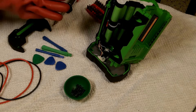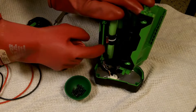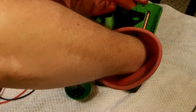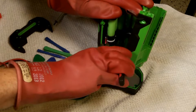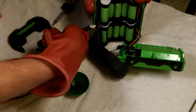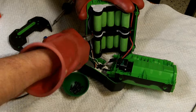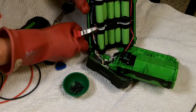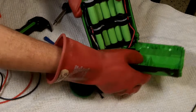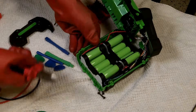Because I am disassembling this, I'm going to cut this mid-pack connection point here, which is halfway through the pack. That converts this from a 56-volt battery pack into two half-packs, around 28 volts each. I bend those apart so they're not touching each other, and now I have two half-packs which are somewhat safer to work with.